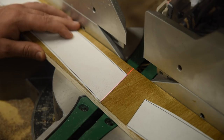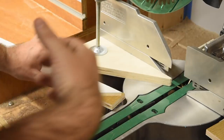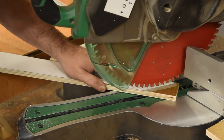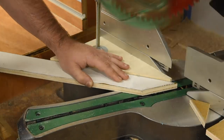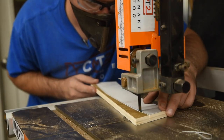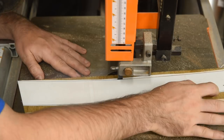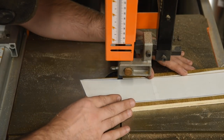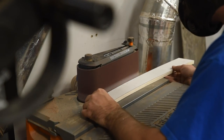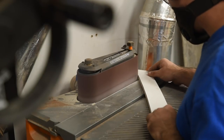I use the laser on my miter saw to match the angle and then cut them. But some of the angles on the templates were greater than my miter saw could swing over, so I made a quick wedge to clamp against my fence that would bring the angle into the range of my saw. For the curves, I go over to the bandsaw and just cut outside the line. For long fair curves like these, I find it easiest to stay on track by using just one hand to move the piece forward and keeping my other hand stationary on the bed to steer the piece. The bandsaw is a bit rough, so I smooth the curves on my spindle sander. Hand sanding, like all other forms of masochism, is always an option if you don't have a spindle sander.